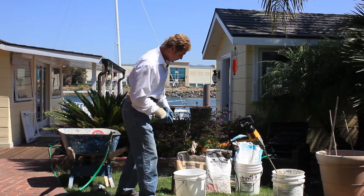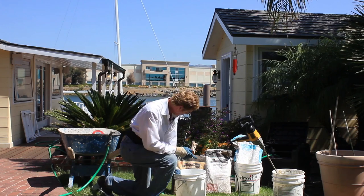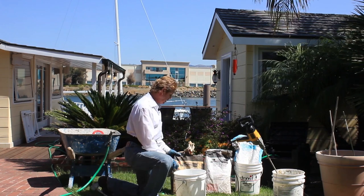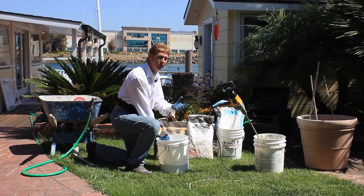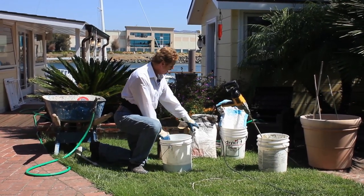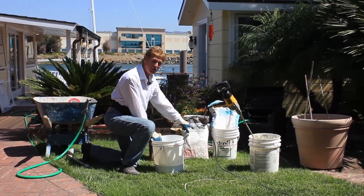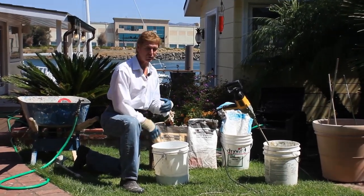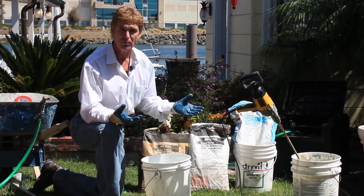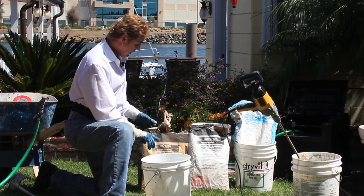What we're doing today is a two-coat system. We're going to use this imperial veneer base coat. Then after that sets, which is usually about an hour, we're going to apply this veneer finish. And usually we're going over sheetrock, drywall, plasterboard, gypsumboard — same stuff.